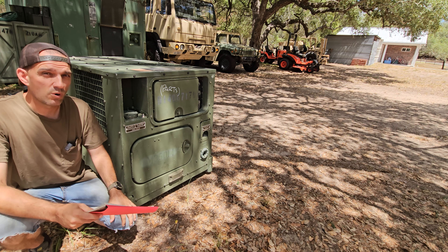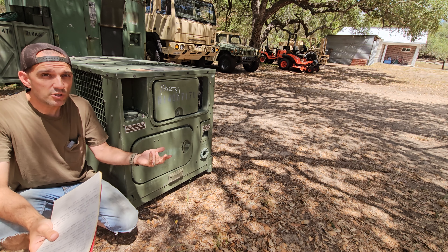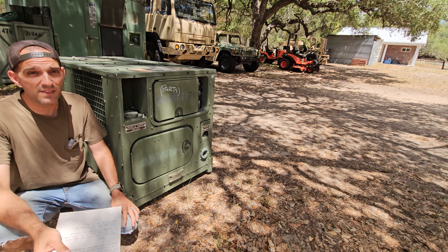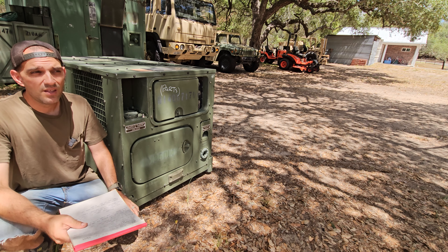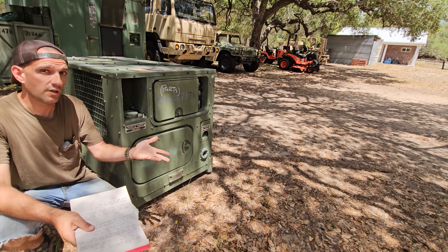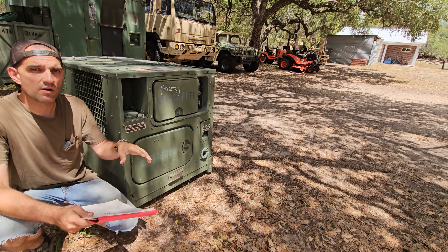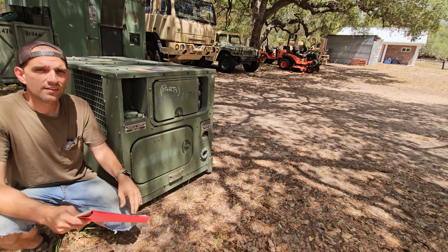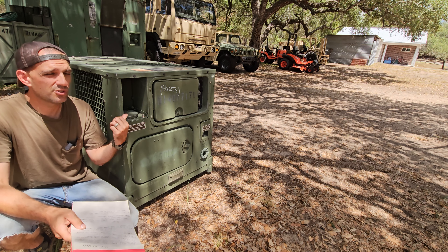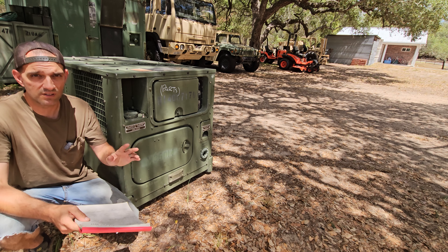This should do that instead of just having a soft warning, because let's face it — it's a perfect case in point. Sure, I kind of know a little bit about what I'm doing, but my background is I'm a Marine Corps infantryman. So if you issue this to a guy that's just out in the field pulling power from it, it's giving a yellow warning, it didn't shut off, must not be that big of a deal, and you're just going to keep using it and burn it out. The yellow warning should be programmed so it lets you run for a certain amount of time and then opens the contactor with a red warning and shuts the load down. The firmware is considered classified by the military, even though this is just a generator, so unless someone active duty knows if it'll trip on overload, let me know in the comments.